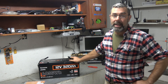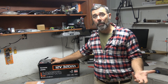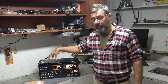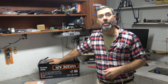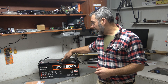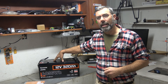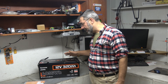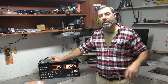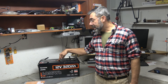Where could you use this thing? For me, it's going to power an actual building, or help power a building. But for a lot of folks, the main thing would be to replace a series of lead acid batteries in your camper. If you have a lead acid battery that's 100 amp hours, you can only draw it down 50%, so that's effectively 50 amp hours of usable energy. This is a 320 amp hour battery, and with lithium you can run it down to zero — no damage done — and bring it back up to 100%. So in reality, you're looking at the equivalent of 600 amp hour lead acid batteries — actually like six and a half. And it fits in the size of this. It's heavy, but still less than 100 pounds, while a single 100 amp hour lead acid battery weighs around 70 pounds. You're probably going to get better fuel mileage as well as a much more compact unit. In fact, you could put two of these in the place where six lead acid batteries were and have 12 times the available reserve capacity — enough to probably run an air conditioner for half a day, at least a mobile unit.